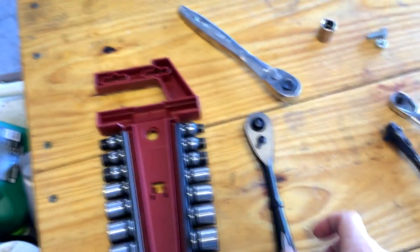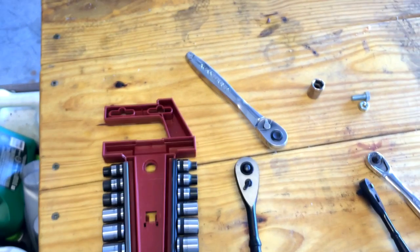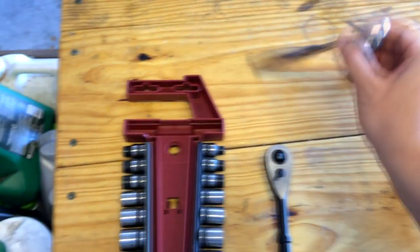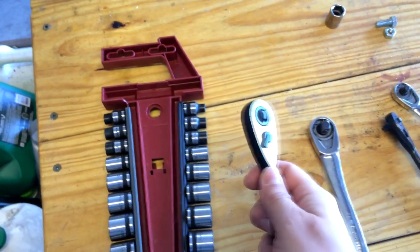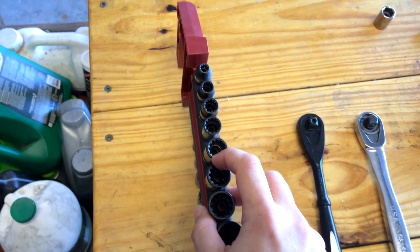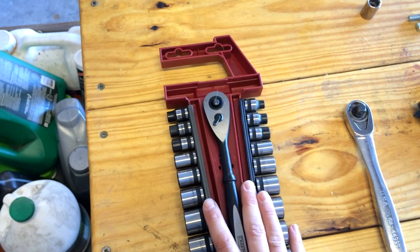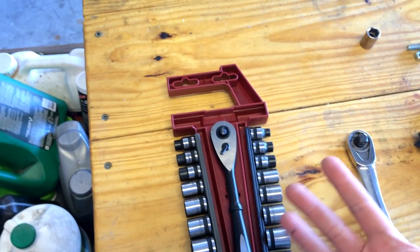The difference is that you have a much larger play area when using this. So if you're doing any kind of fine work, you're going to want less play. If you go to Matco and buy a really nice ratchet, you can get up to 88 teeth, which is quite a bit. However, I actually kind of like having less because I'm able to get more power out of it. That could be a problem when you come up to the universals, which is the next test — am I going to be able to strip one of these? I use this for inside house use only; I don't use it for automotive because I don't want to put a lot of force on one of these sockets, thinking it's going to break a bolt.